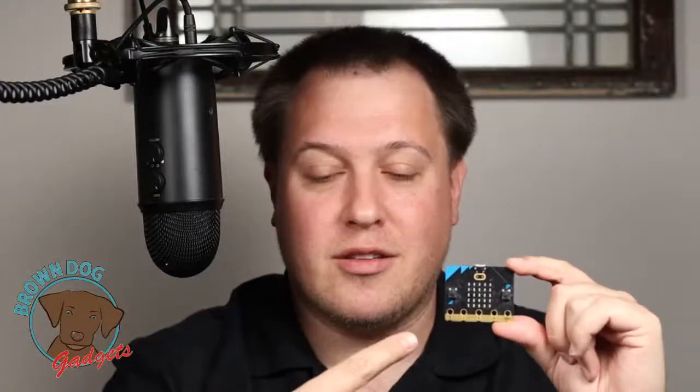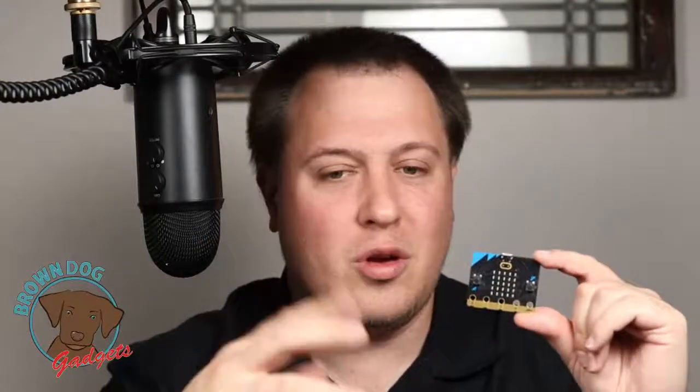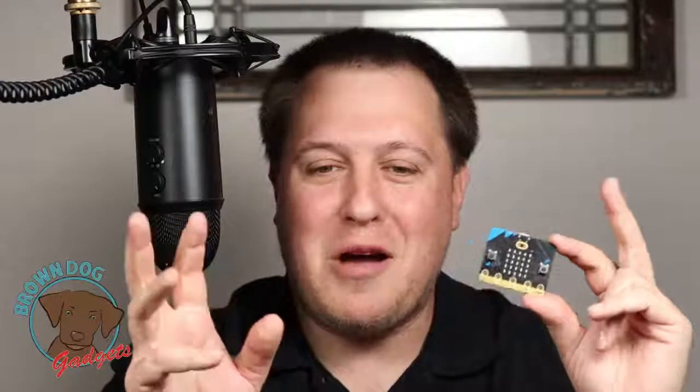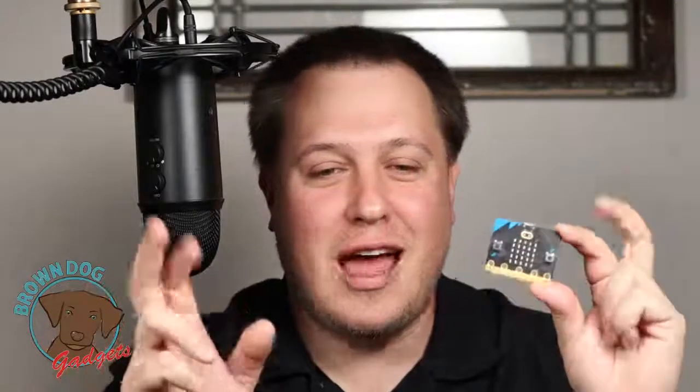So having built-in capacitive touch on this guy, even though it's 1, 2, 3, possibly 4 points, is really cool. You see that on higher-end boards like Arduinos, Teensyduinos, and some other microcontrollers as well. We use that actually for our sound wall, which is behind me here, because we're live streaming in the hallway this week and part of next week as our new office area gets done. It lets you do some really interesting projects and not do the old way of having to hold on to ground with one hand and then touch things. That's resistive touch. It's not as good. It's so 2013. Capacitive touch is much higher tech, but equally easy to implement. And this has it in there.